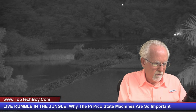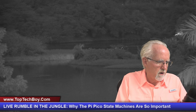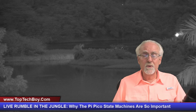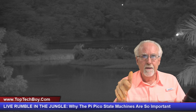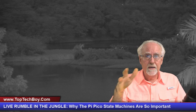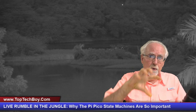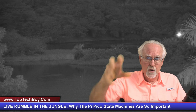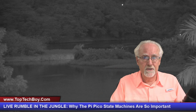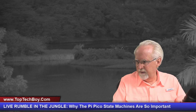So let me see if I can come over here and draw for you what the state machines are doing. Okay, what language is the state machine written in? Well, really what I would say is it's kind of assembly. We're going to be programming in something that is very much akin to assembly, but we're going to be interacting with the state machines through Python, but it's not Python code. We are going to compile assembly code and send it down into the state machines, and then Python is just sitting there on its own. Python then doesn't really have anything to do with anything at that point.